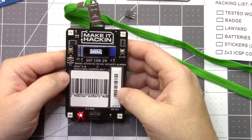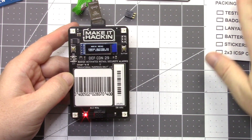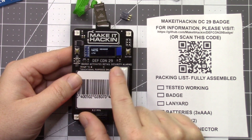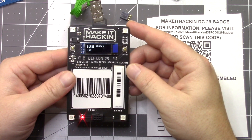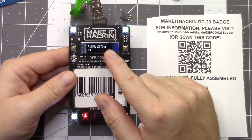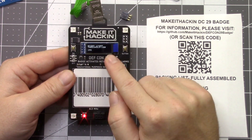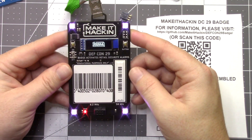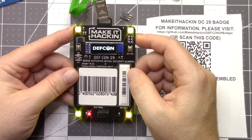So let's turn it on. We turn it on and we get the loading screen. Right now this is just demo software — if you want to, you can load extra stuff onto the badge. Press button to test components, so we press the button. Here we have a light sensor value readout. Over here there's a light sensor, and if we cover it you can see those numbers change — this is an analog value from 0 to 1023. If we press the button again, we go into the next mode, which is nightlight mode. It says threshold 100, and that's reprogrammable. Anytime the light sensor senses less than 100 on that pin, it turns the lights on, so it kind of acts like a nightlight. Press the button again and it goes into demo mode — it's basically just flashing the LEDs different colors, changing the text on the screen, and it also reads out the light sensor value.